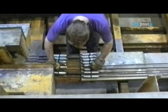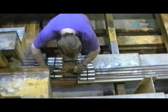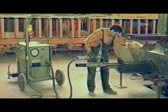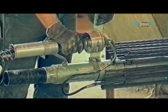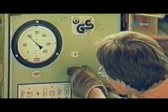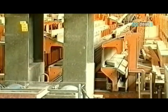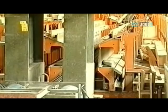Pre-stressing steel couplers economise on pre-stressing steel if the casting bed is longer than the concrete element produced. Before the actual pre-stressing, all the strands are tightened. The oil pressure required for this is set on the pump unit. As soon as all the strands are drawn in and tightened, the mould can be closed.